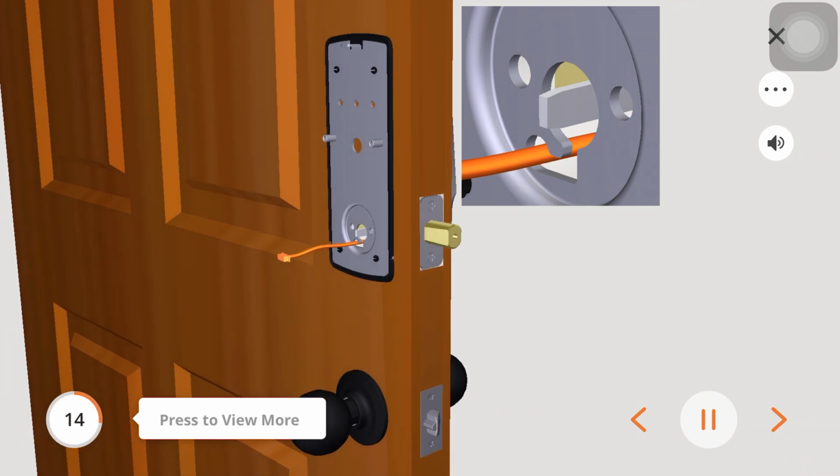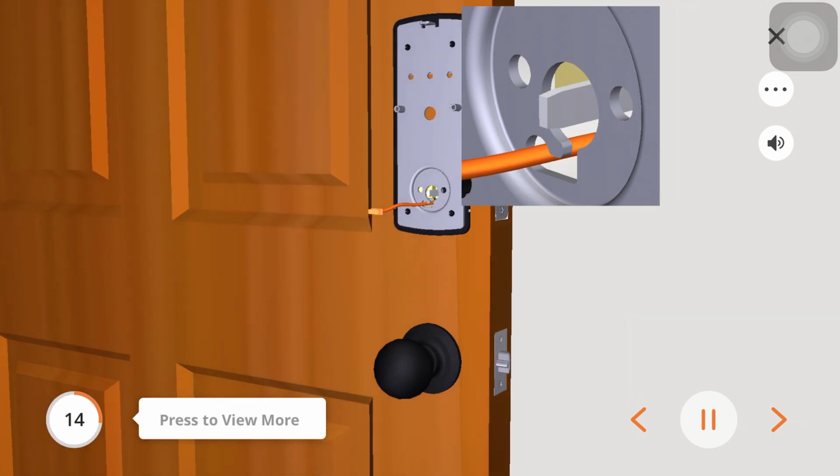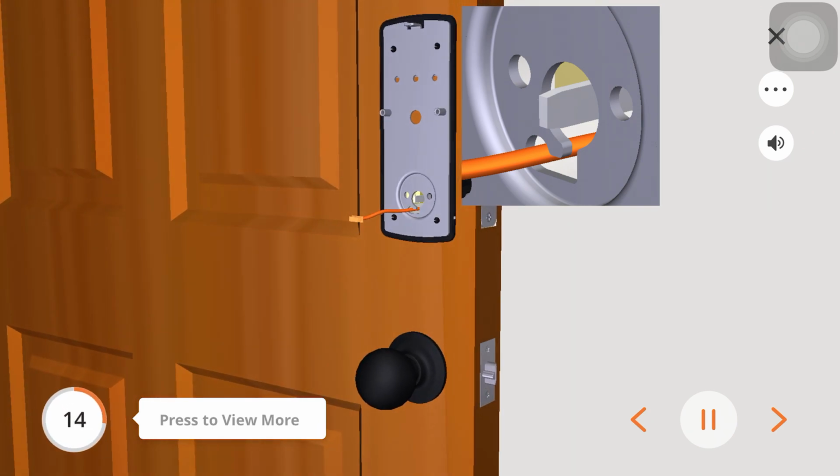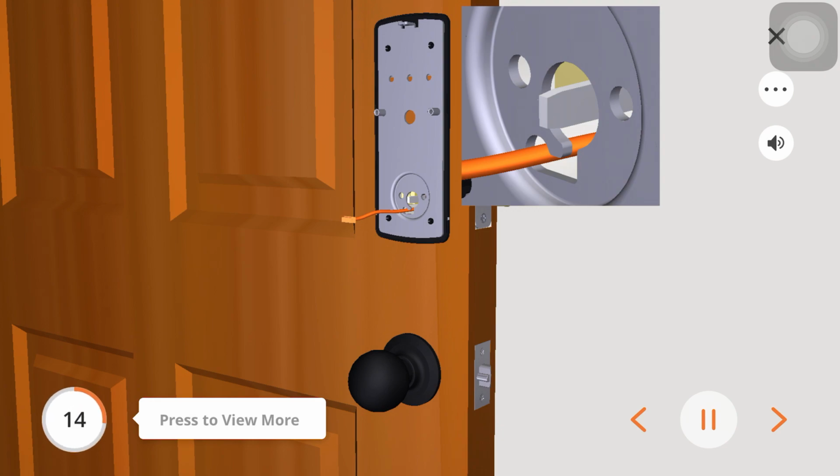The mounting plate should be placed such that the torque blade is in the center of the circular opening. Visually check the alignment of the mounting plate through the screw holes on either side of the circular opening. Route the cable through the slit connected to the circular opening.